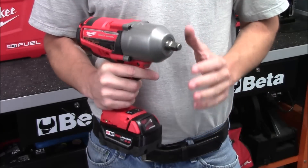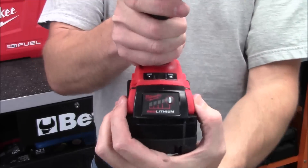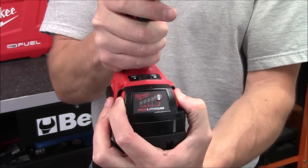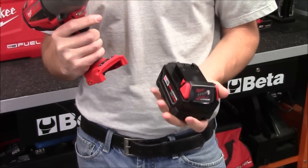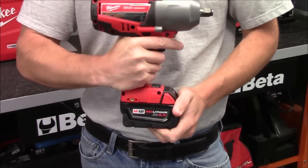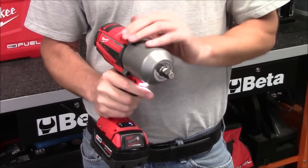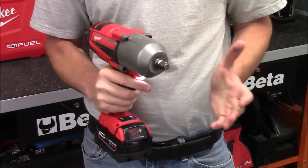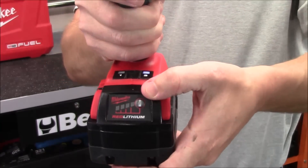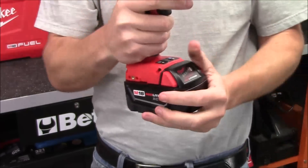Like any of the other tools in Milwaukee's M18 lineup, the battery is going to be on a slide rail system. To remove it, you'll take the large red button on both sides of the front of the battery pack, press and hold those in, and then just pull the battery pack forward — it's going to slide right off. You can take a fully charged one, slide it in place, and when you hear the click it's going to be locked in and ready to go. The M18 tools do not have a fuel gauge on the tool; however it is on the front of the battery pack. You can simply press the button on the front, you'll see LEDs light up, and it will show you the current charge of the battery pack.